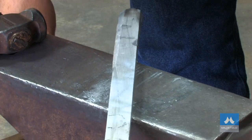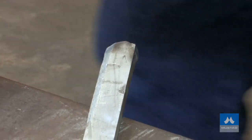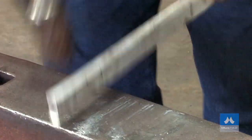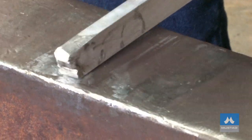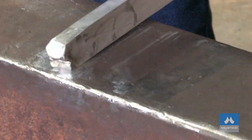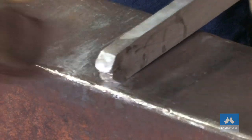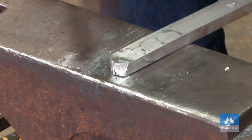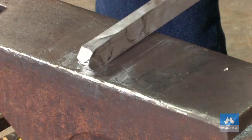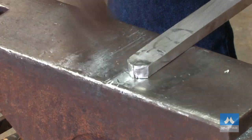Basically what I end up with is the lateral extension and the bearing surface of the shoe. The bearing surface will, by the time I come back to it, be flattened to the normal width. I'll turn it and do the inside heel — a normal type inside heel. I'll take a lot of time doing this because this is the finish.